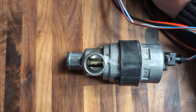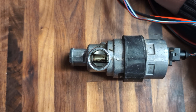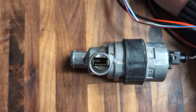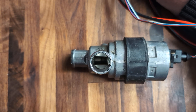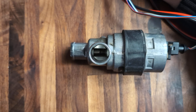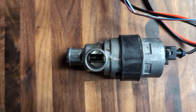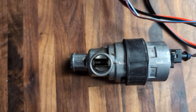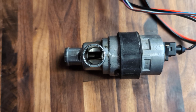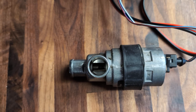I'm turning the power back on at 25% PWM — you can see it closed more fully — and now I'm opening it back up: 35, 45, 55, 65, 75%. The nice thing I'm seeing in this valve is very smooth shutter movement. As I bring it back down it closes absolutely beautifully, and as I open it up it opens perfectly. This is a good valve — I could count on this to idle my car correctly. If I saw it getting stuck or not moving smoothly, I'd have concerns. I pulled this off a running car, but I wanted to illustrate how it should look for someone who wants to test their own.